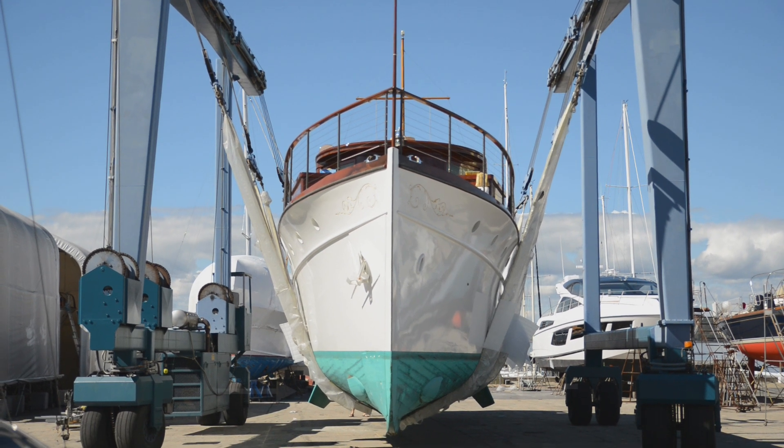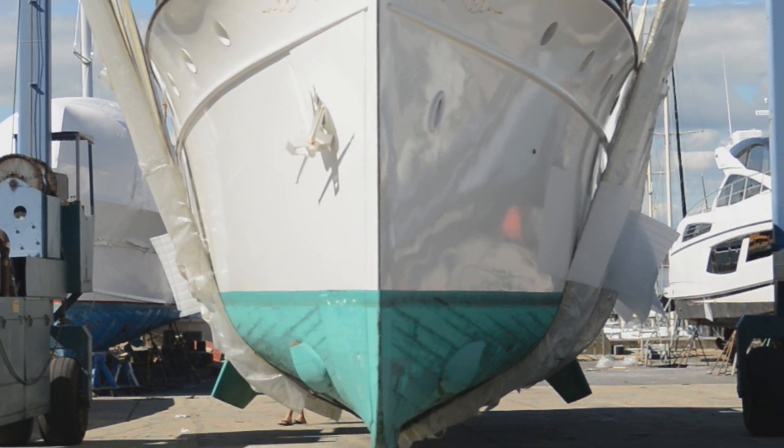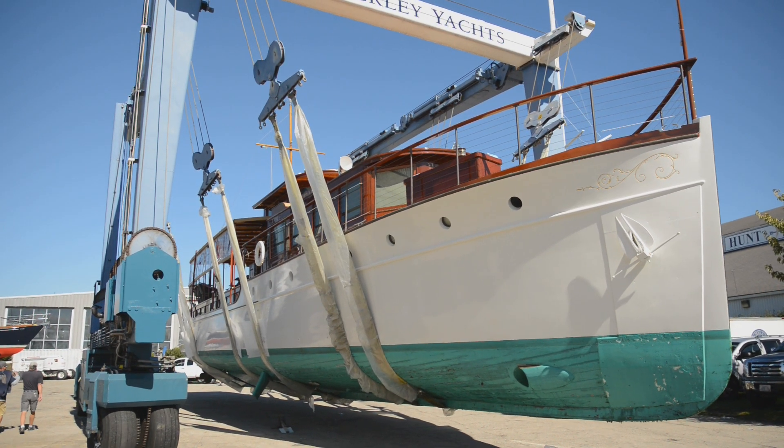There are a couple of different ways boats are stabilized these days. Fin stabilizers — essentially little wings coming out the side of a boat — have been the mainstay in boat stabilization since about the 1970s, and that's something we've done in the past. One of the downfalls of fin stabilizers is that they point-load the hull too much. In a wooden boat you're always trying to spread the load over a larger portion of the structure, and with just two fins you end up seeing a lot of movement because all the righting moment is happening from two spots. Fins are located below the waterline, they require the boat to be in motion and water flowing over those wings to stabilize the boat.